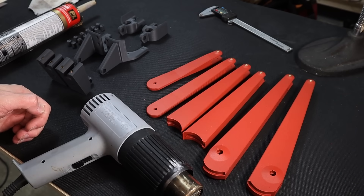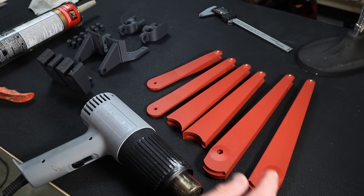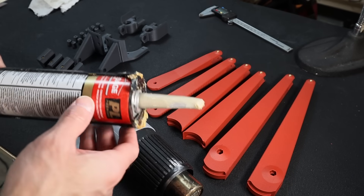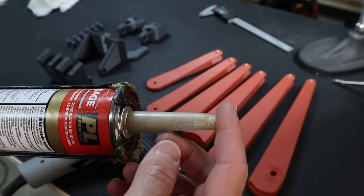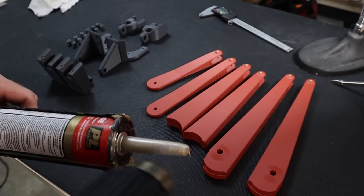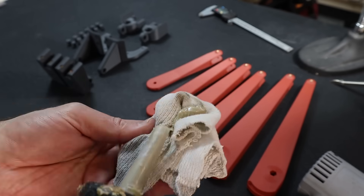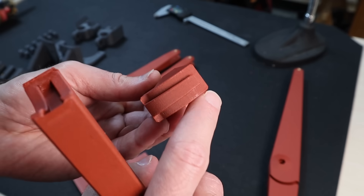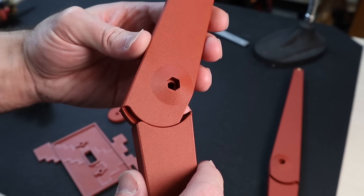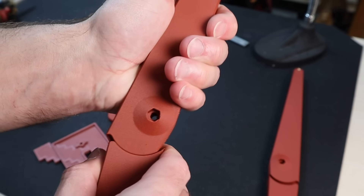It's come time to put these together. I'm going to glue the joints — gluing is not required, at least it shouldn't be, but it really depends on how tight the parts come together for you. Mine could be a little tighter since these were kind of the test run, so I've snugged up the joints and I'm using polyurethane because it works well with PETG. If you have a tip that is completely dried up, you can take a heat gun to it, soften it up, and it should expel the plug. The dovetail joint is tapered, and the corresponding piece is also tapered, so it goes in easy and gets tighter and tighter as you push it further until it snaps into place.